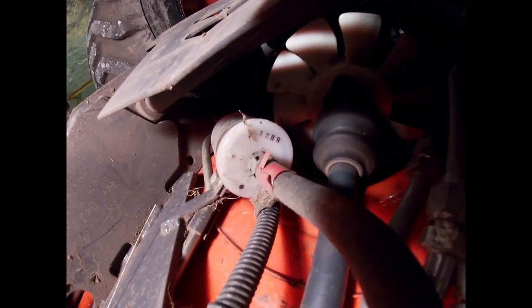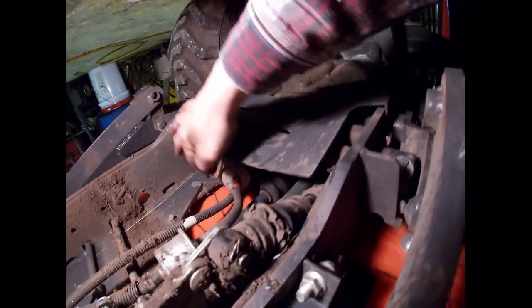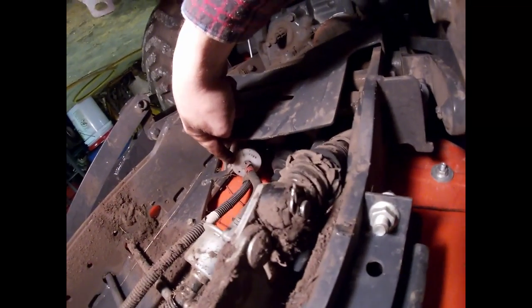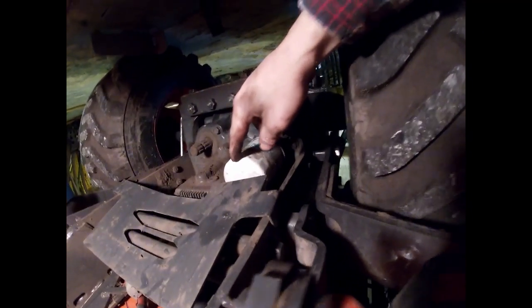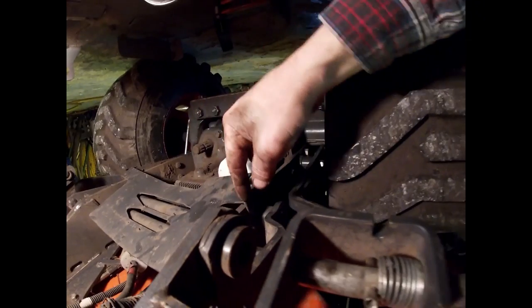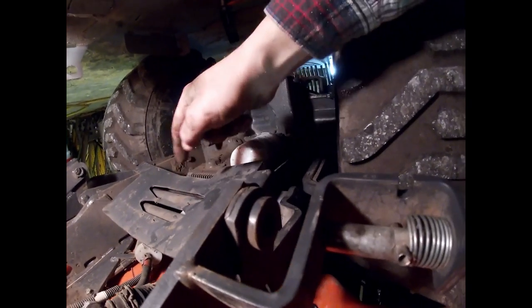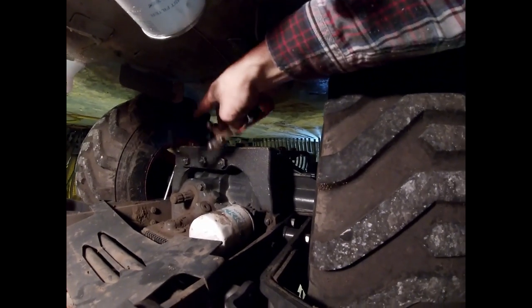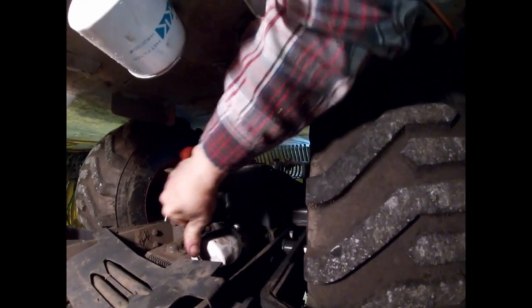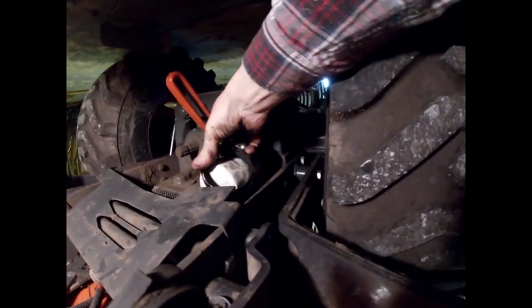There's your other fuel filter, it's up under here. The little plastic one is the filter; the metal casing is the pump. The plastic one comes from the fuel tank. This is your hydrostatic transmission — hydraulic fluid — and it's a pain to get to because the plate right here is bent on mine, so the wrench won't go up in there very easily.